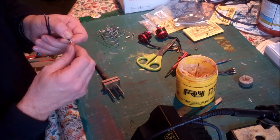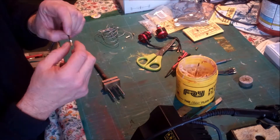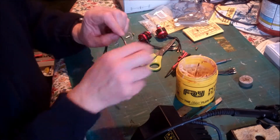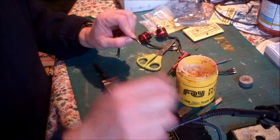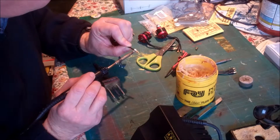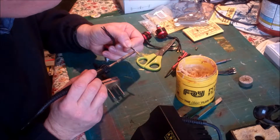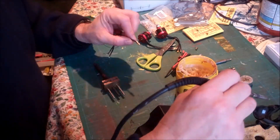That's it. A bit of excess solder on that one, but I'll just not fill the next one up quite as much, because it flows out of the holes in the side of the bullet connector. But still, that's quite good. I'm not an expert solderer, but I can get by. Use a bit of flux to tidy it around, just to make it look a bit prettier so it doesn't interfere with the actual winding bases. That should be okay.